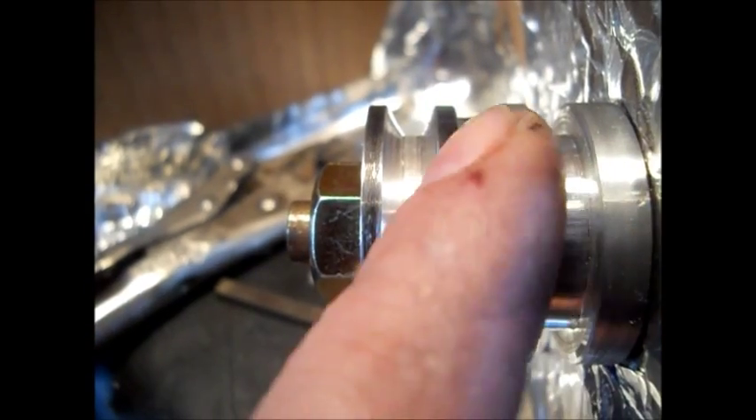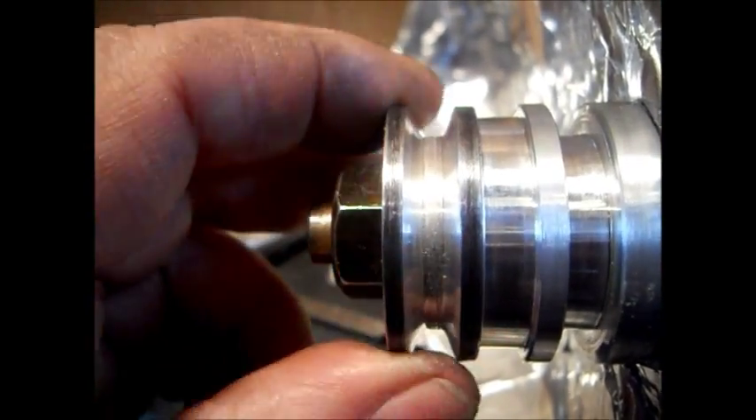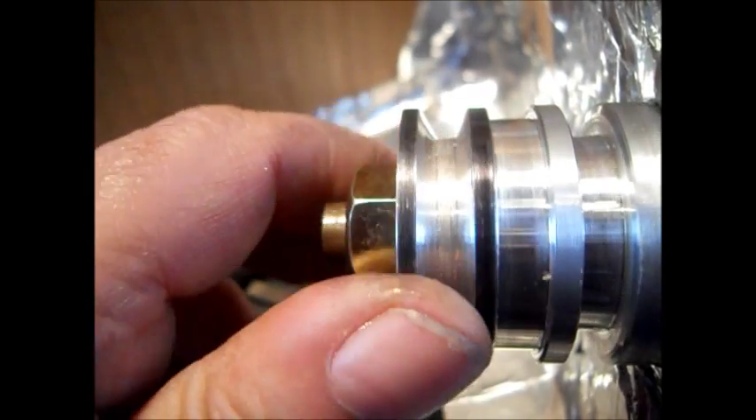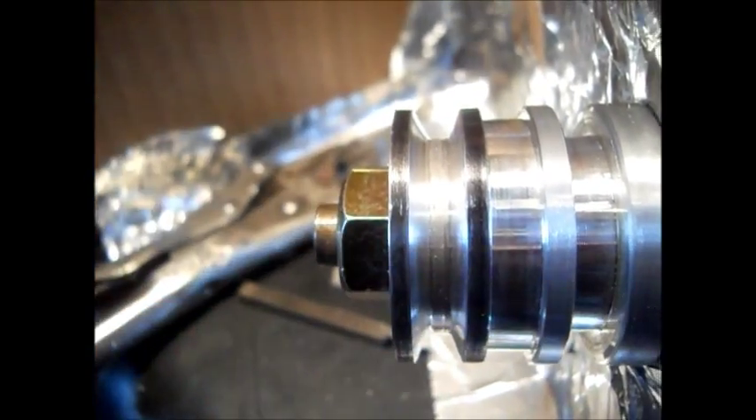There you have it. It's a little rough down on the bottom. I tried to clean it up with a file, but the files I have are pretty nasty. So we're going to use some emery — like 120 emery paper — and fold it just right, just to smooth the bottom, even though the belt will not hit there.